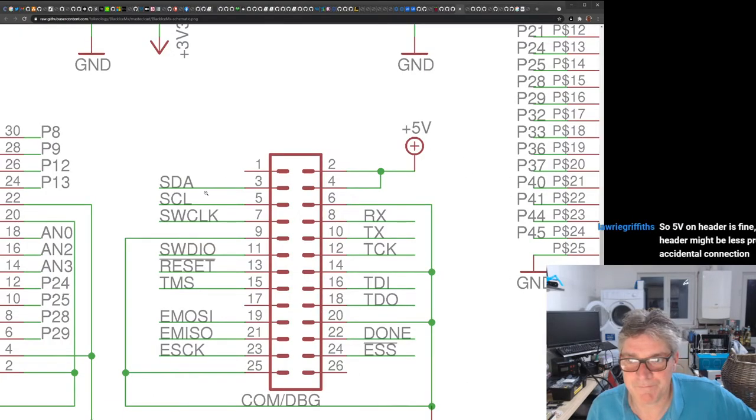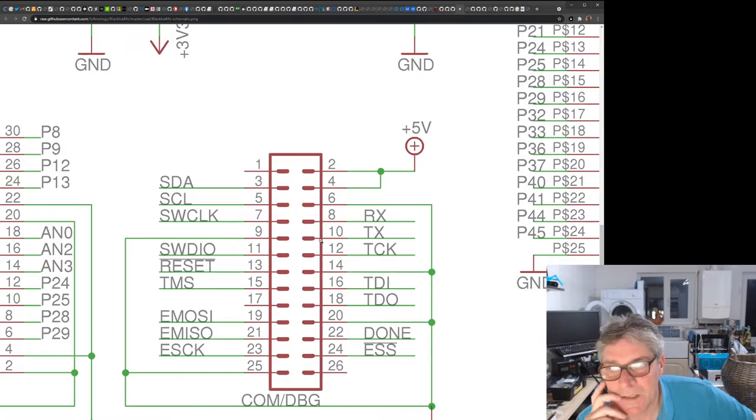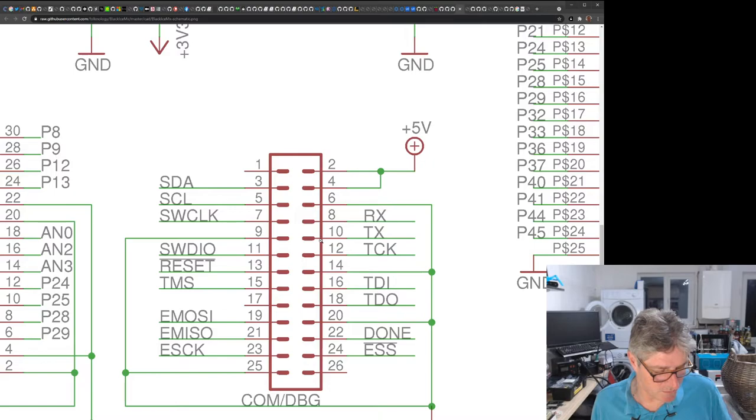Because the other thing that you could do there that was quite interesting was you could use SWD in this, or we also had the TCK, TDI, TDO, TMS pins mapped out on that as well, even though they weren't used on the iCE core. I do hope I've got them down the right way.